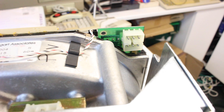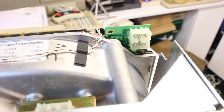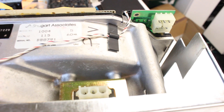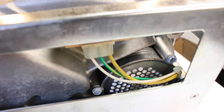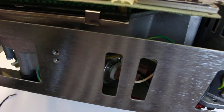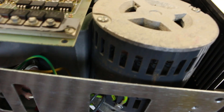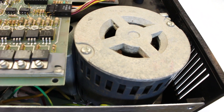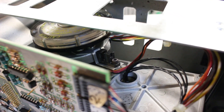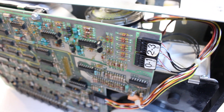There are the two molex connectors on the motherboard. In the manual which I found online, it says one's 24 volts DC and the other one was minus 5 volt DC. I'll double check that in a bit when we look at the manual. And that's your AC connector there for the motor. So that's going to require two power supplies to get this thing fired up. Just there is an air filter canister. The AC cable comes around the back through the side into this giant capacitor - it looks like one of those metal canister capacitors you'd find in a microwave oven. Then it goes into the large AC motor. And just on the side there is the stepper motor which controls the heads, with fine cables coming out the side from the heads into these connectors. I bet this makes a right racket when it's powered up.